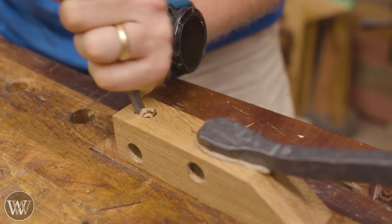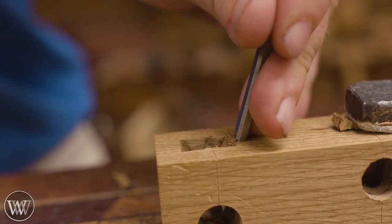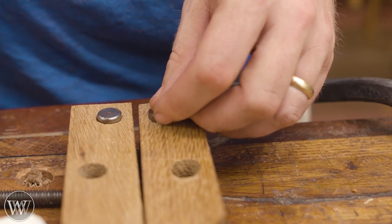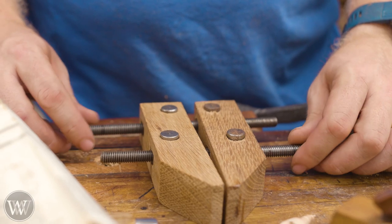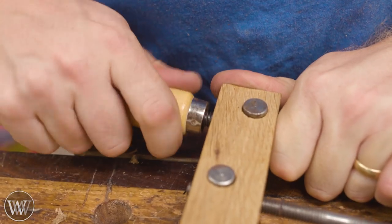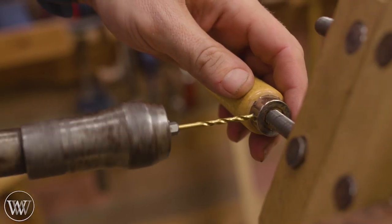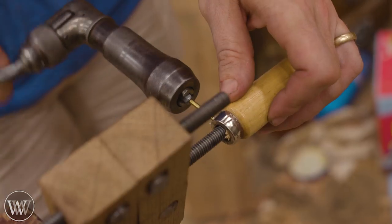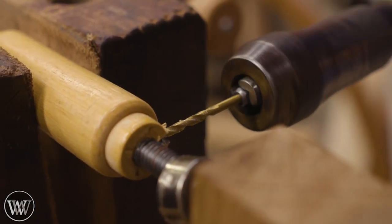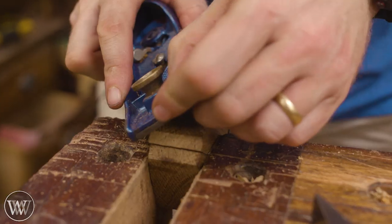The version I have is actually an old version of the plans, which is a little harder to understand, but the new ones are a lot better. So we're chopping in at an angle, which allows the screw to go through the block into the insert and move around a little bit. Now we can put in the inserts. The blocks ended up not as wide as the inserts — I wish I could have made them wider to match, but alas I did not. There we have a functioning screw clamp except for the handles. The kit handles thread on — it looks like I'm turning it off but I'm actually turning it on because it's left-hand screws on one side and right-hand screws on the other. Then you drill a hole through the handle, through the threaded rod and out the other side, and drive in a pin — that's how they hold in place. On this one the little ferrule popped off, so I drilled it mostly without the ferrule and then popped through the other side with the ferrule in place, drove in the set pins, and there you go — a functioning clamp.